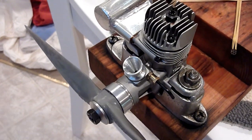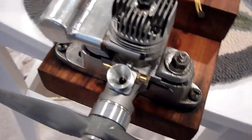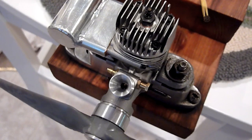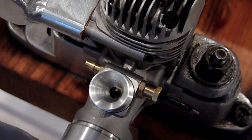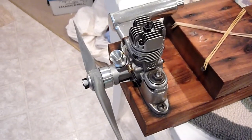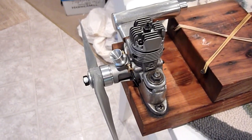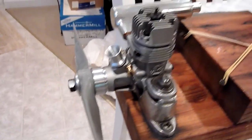I got a lathe about a year ago, so I recently machined a true Venturi, which you can see here — and you can see if I can zoom in on it — it has a tiny spigot inside. The effective cross section of this Venturi falls into the range that Klaus Mikus recommends starting with for an engine of this size.